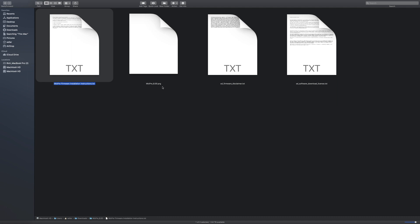You can go to your Mix Pre, do file transfer so it opens up as a drive, and just drag and drop this into the root directory. Alternatively, you can use an SD card adapter and put it on that way. Probably the easiest thing is to hit file transfer on your Mix Pre, open it up as a device or drive, and put that PRG file in the root directory. We'll go to the Mix Pre and show you how to do that from beginning to end.